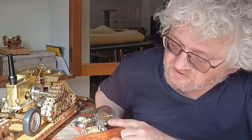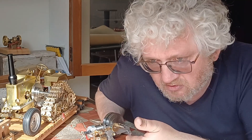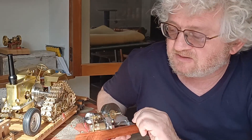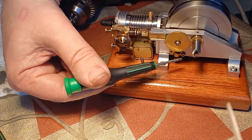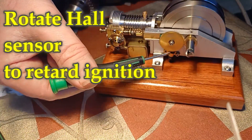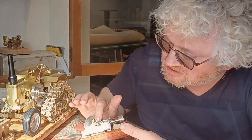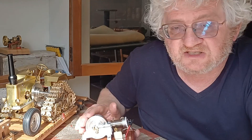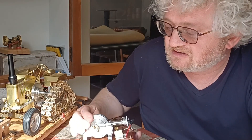On this engine so far we've changed the ignition point to just after top dead centre, which really helps when these are at that slow, slow point that they get down to in the miss, where they then need to fire again at such slow RPMs. You can see down there where I've advanced that to - it's on an angle. Taking the whole sensor a little bit further this way as this wheel comes around, delaying the ignition a little bit just after top dead centre.